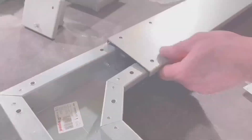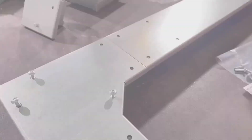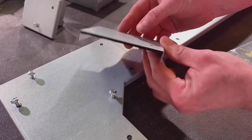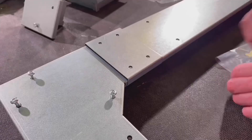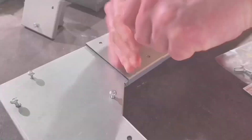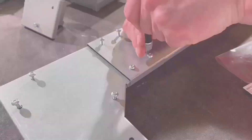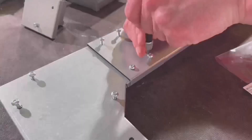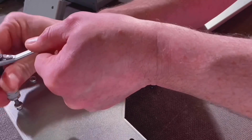You can't over-tighten gaskets - that's when you get into problems. Lids gone on. Now we're going to pop on the 90-degree section. That's not acceptable as it is - you need to put the cover strip over the top of the joints. A couple of lids go on. These screws are 16mm in order to go through both - through the lid and the coupler itself and into the body of the trunking. There are four of those to go in, and we'll replace all of them in order to get the IP55 rating restored to this Salamander trunking.